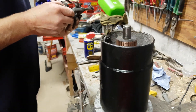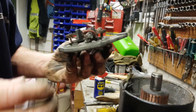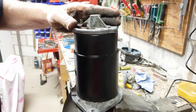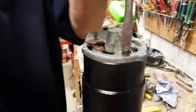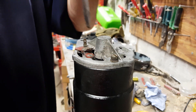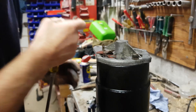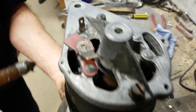We want to put a little bit of copper slip or something in here - actually we'll just put a bit of oil in, it's just a copper bearing. Now we slide this on - it can't go on in the wrong place because it can only go on where the wire can go. That slots on nicely. Let's put the screws in - be careful doing these up that you don't twist it because it won't spin. Lovely, spot on. Put a bit more oil in there - you see the oil going down and an air bubble coming in.